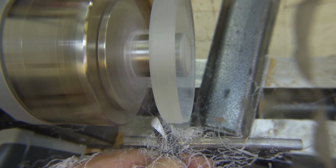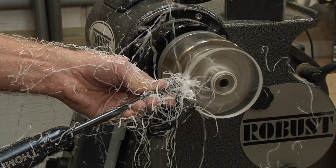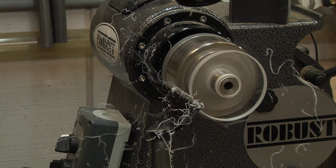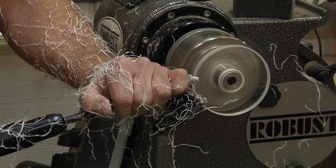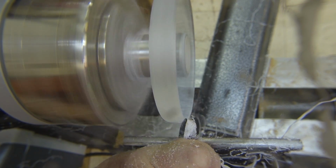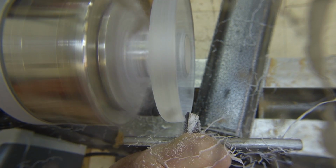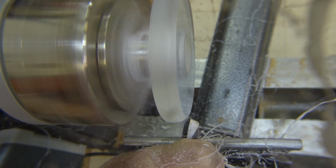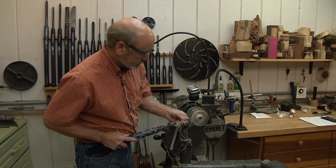which actually is nicer. I'm going to put my curve on here. There we go. Some of those fun shavings that you get. You put a radius on here, and you want to put probably about an 1/8 inch radius to give it a nice little shape, and you want to see this feature when the light's on, so it's got to be a certain size. Whoops! See, I went too fast and I shattered a bit. That's what you call design modification.